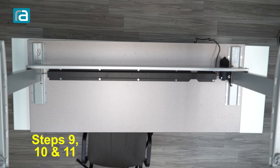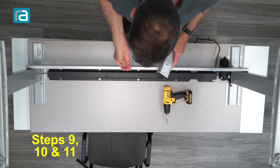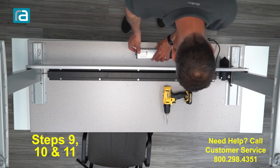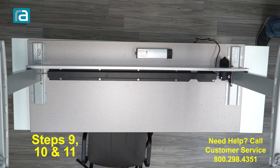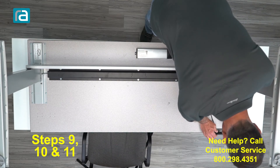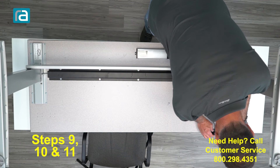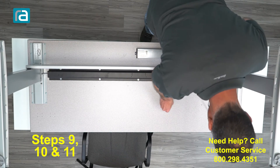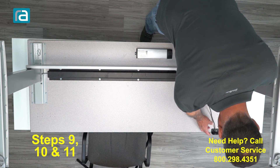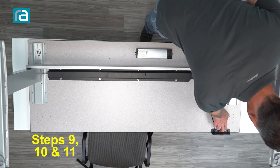Step nine is going to be installing the control box and the switch for the control box. With the control box, you have smaller screws for that unit and for the switch as well — they are the same. They're just a little bit smaller than the standard screw. I like to have the power off to the right. You're going to see there are pre-drilled holes. You're going to find there are three small holes in the front: two of the screw holes are for the standard two-button switch, and if you use the programmable switch, you still use two screw holes but they're the outside holes. There's a hole underneath here, and your two-button switch would install right there.